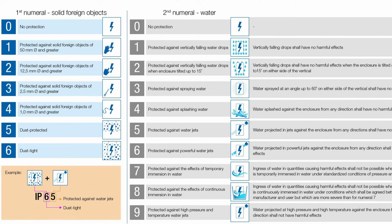You might see a rating like IPX7, where the X means there's no rating for that category — in that case you've got no rating for solids but a really good rating for liquids. IPX4 means protection from water spray, whereas IPX6 means protection from high pressure water in any direction.